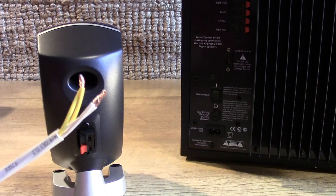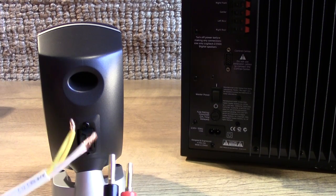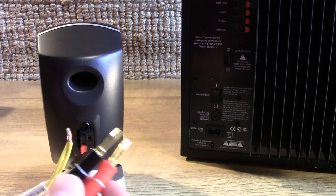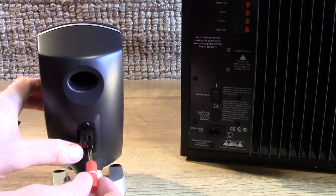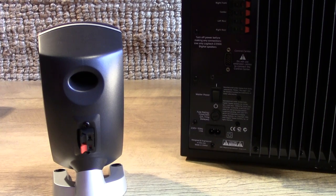So what do you do? Well, normally you fit plugs on the end of the wire. And you'd fit things like these - normal banana plugs. You put these on, they screw on, you put the plastic sleeves back on, and job done. You plug them into your amplifier. Everything's great. And they don't cost all that much. Slight problem - these spring clips are way too small for banana plugs. So you could get some proper banana plug sockets, take this off, put this inside, solder it all up. Then your banana plugs will fit perfectly, but that's a lot of hassle. There's a much easier solution.